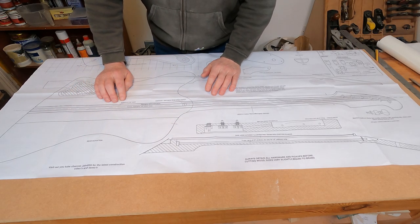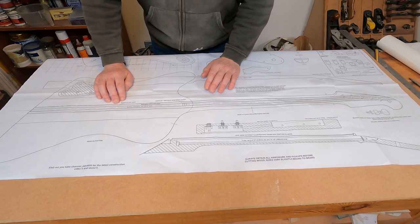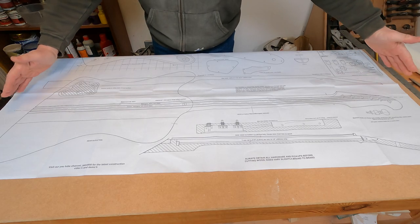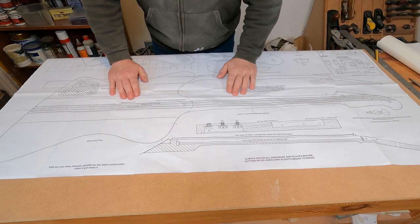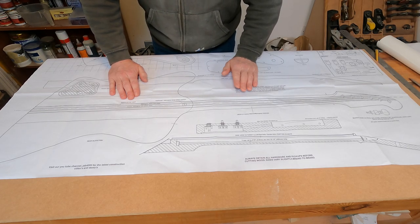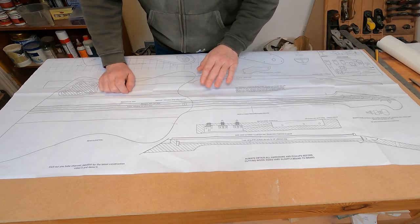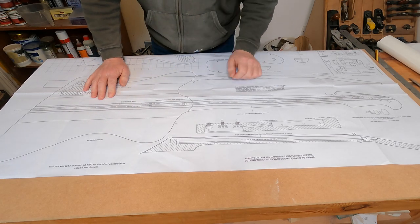Now, I have got no way of cutting pieces of walnut 1.5 millimeters thick. I just simply can't do it. The other issue I have is that I haven't got a piece of walnut long enough to do that with. So that's a non-starter. So thinking a little bit outside the box, but in terms of what people are doing with modern guitar construction, it really isn't that much, because we see people accent their multi-laminate necks with bits of veneer all the time. So what I'm going to do is use veneer instead of those slices of walnut.